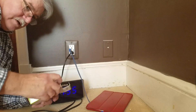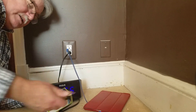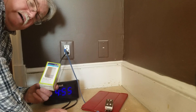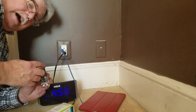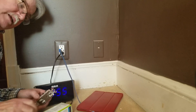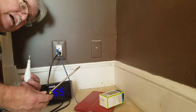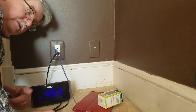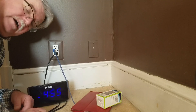So that's how we went ahead and did a very simple do-it-yourself project — taking a regular outlet and turning it into a USB outlet using the Leviton product. Now if you have outlets that are circular with circular holes, all you need is to get a Decora plate to replace it and you can do the same thing. We used just a couple of screwdrivers and some needle nose pliers, turned off the power, took out the outlet and put the new outlet in. Done in probably under 15 minutes. We'll see you next time.